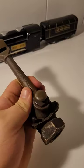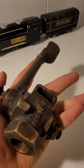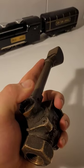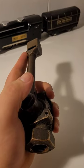The second feature is if you rotate this whole assembly with the whistle backwards, air will actually dump out of the brake line, which the whistle takes its air from in the first place, allowing you to use it as an emergency brake handle.